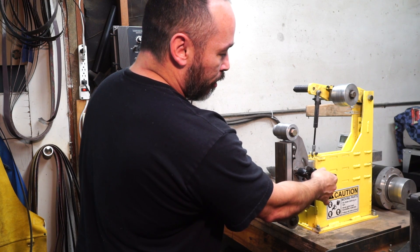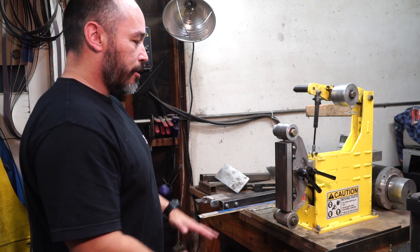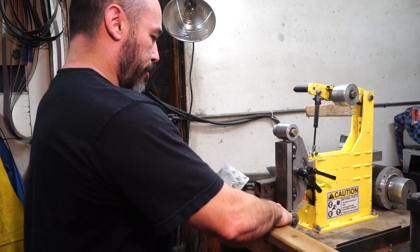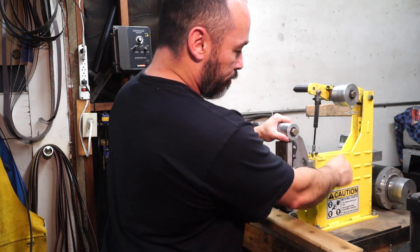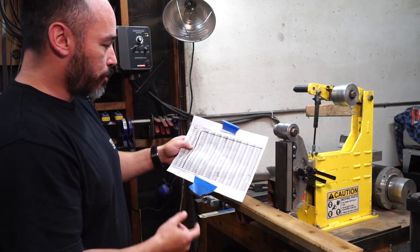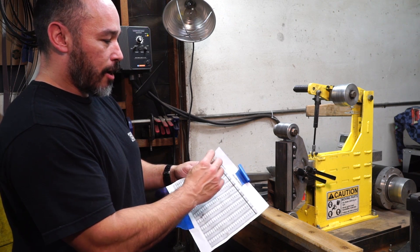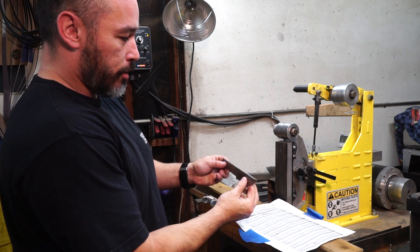I also added these quick-moving adjustable bolts because of the way I grind. I jig grind — I set up my tool rest flat, tighten it down, adjust this to the angle. I use one of these charts off Google — basically a chart of blade angle grinds.